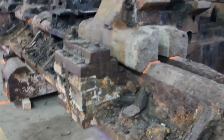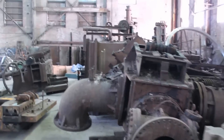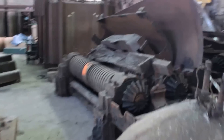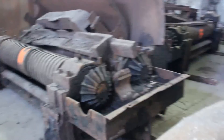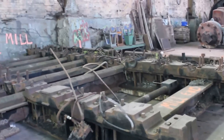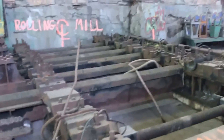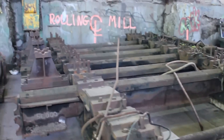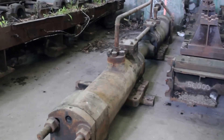What sits here is the beginning of the roller table. The two roller tables are sitting back over here — one on each side, up against the mill, locking into place. The rollers go all the way back — I think we've got ten on each side — and the plate would roll back and forth on these going to the rolls. This item here is the reverse gear for the engine — a very large power reverse, but hydraulically operated.